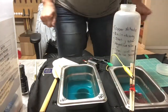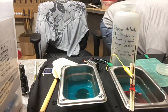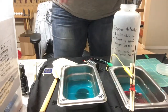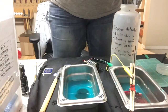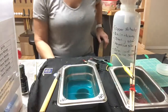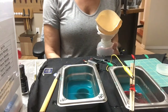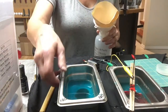It's night time for the plug-in electrical etcher — I'm just running on the battery pack etcher now because it's so fast. The electrical etcher will take at least another 45 minutes minimum before it gets a deep enough etch for enameling. Yesterday I ran it for about two hours and it still wasn't quite as deep as I'd want it.